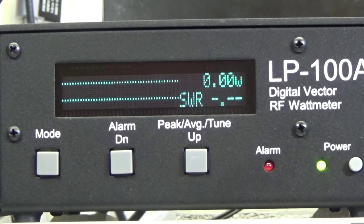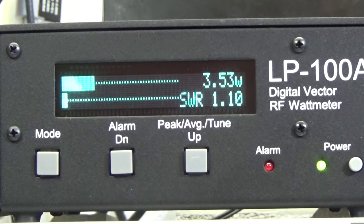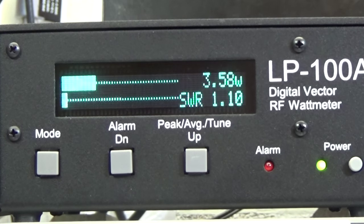Okay, so then let's start with our transmitter tests, and first of all, power on FM. Our power meter is switched to average, and that is a well-known picture. As we discussed before, all the manufacturers are very careful with setting these values. So we are below the legal limit of 4 watts. Okay, but basically it is okay.